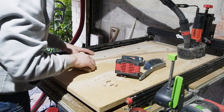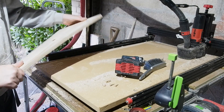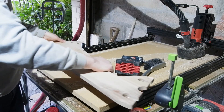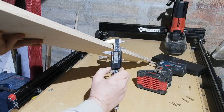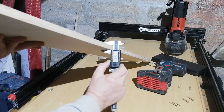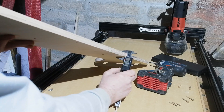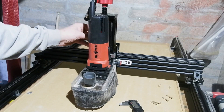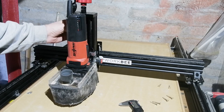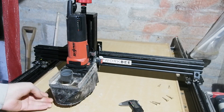It seems to differ a little from board to board, but what matters is that we're in the vicinity of 16mm. With the digital verniers out, you can hopefully see we're between 16.1 and 16.13 on this side — much the same on the other. There's a minor high spot at one end reading 16.3, and I had this same high spot on every piece for some reason, but within two tenths I'm very happy with that, and it's actually better than the original piece before machining.